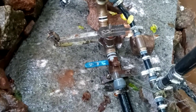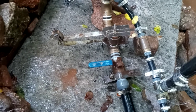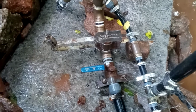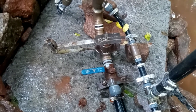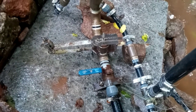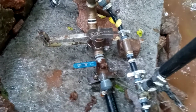I've been going through this issue with my ram where the waste valve would fail to cycle. It would run for five or six hours or sometimes all night long, and it would be running in the morning, but for some reason there was some weird blip or hiccup in the system. I know it's not air — I've troubleshot basically everything you can think of, and what it came down to is the waste valve. For some reason it would fail to cycle, and I got 100% of the air out.